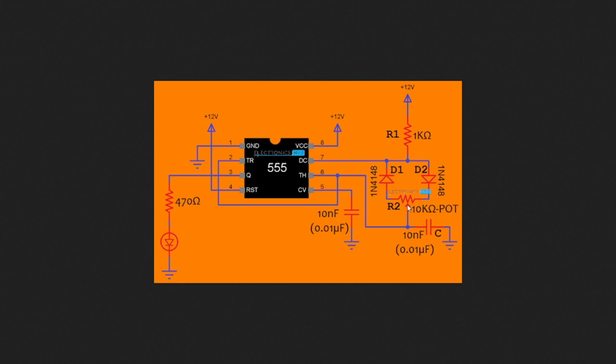to make up for the fact that you've got this extra 1K in the charging path up there. So you could put, you know, 4K and 6K in here as your two resistors. In this case, I mean, you could use any values, you just have to do the math on them. But so that is the basic way of doing it, and it's pretty slick.